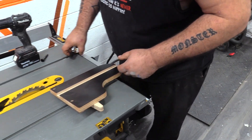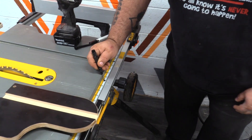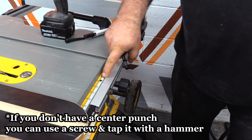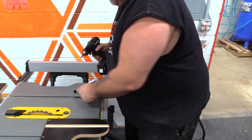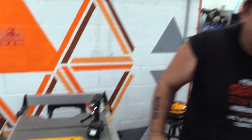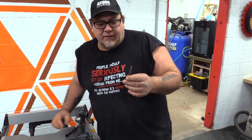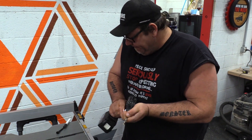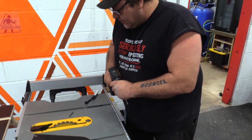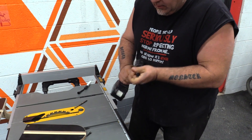Then you'll want to use a set — don't try and freehand it. Make sure you set it so that — in this case we've already drilled the holes — you would take your set, find the center, and set that position. That way your drill bit has a place to find its center. I'm using a drill bit that is slightly over a quarter inch. The hex head bolts in there are quarter-inch bolts, so this particular bit is about a thirty-second over a quarter inch. Then drill your positions and reinstall the hex head bolts.